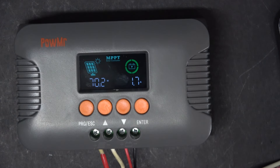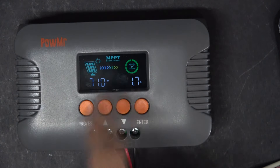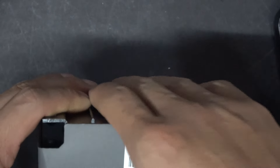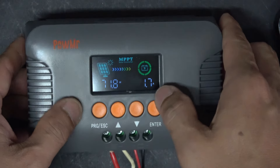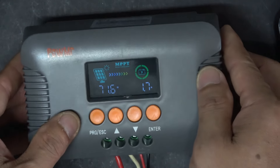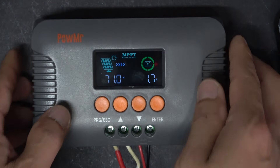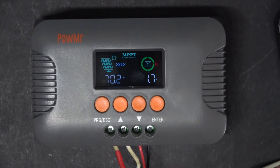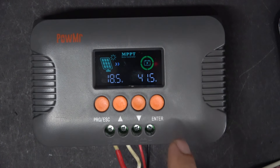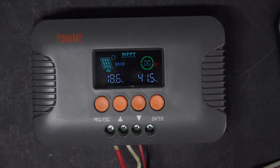I've been charging my battery for about one hour at 1.7 amps, and it does get warm on the back heatsink. So if you charge your battery at a higher current, you probably want to install a fan or put a bigger heatsink on the back, because it's going to get really hot — and heat is the enemy of this charge controller. That's all for this charge controller. I'm working on charging my electric bike with a solar panel and have some flexible solar panels I'm going to try on my bike — I'll show you that next. Until next time, thanks for watching.